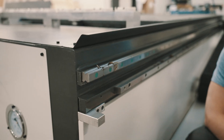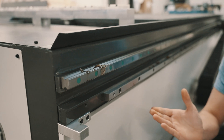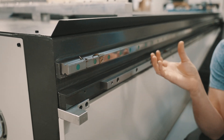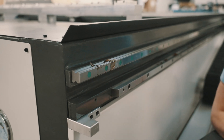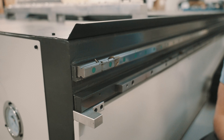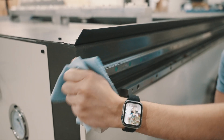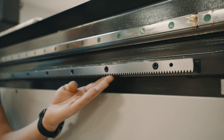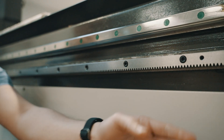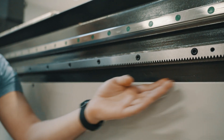Here at the back of our machine we're looking at the linear rail of the y-axis. Part of the greasing process — you may find that debris builds up on this rail. It's important to clean that off and make sure there's never too much of that. Here we're looking at the rack on our y-axis at the back of the machine. It's important to make sure that there's no debris in any of these teeth and that it's maintained and clean.